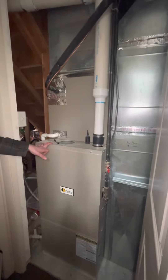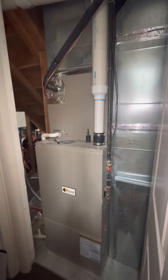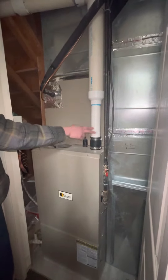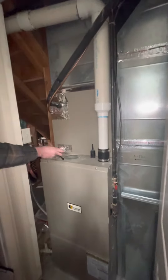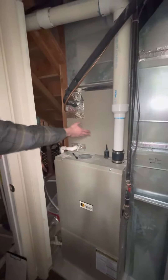This is an 80,000 BTU furnace with a four-ton fan and a four-ton coil up top. We will most likely be matching that after I do the heat loss calculation — that's really what they want overall. We do have two-inch going to three-inch PVC going out. The fresh air intake is right off the top of this unit — we'll just do a gooseneck on the next one, and prefer if you guys can come out this side so we still have access to the coil for maintenance purposes.